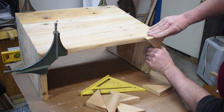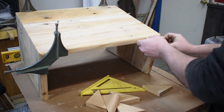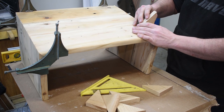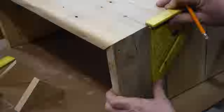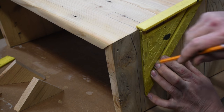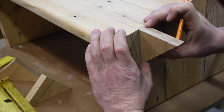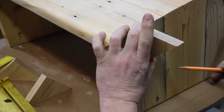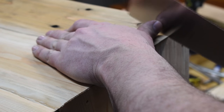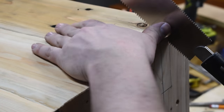There we go — one, two, three, four, five, six. I'm showing you here how that's going to line up. What I decided to do once I got the splines cut is put one spline in the center of each set of deck boards, where they all kind of came together when glued up. I'm treating them as individual deck boards and going roughly in the middle — I didn't measure exactly because it really doesn't matter. I just take the spline and draw onto the laptop stand where they're going to go in order to cut out the right amount of material.